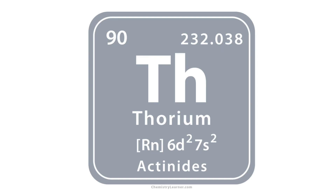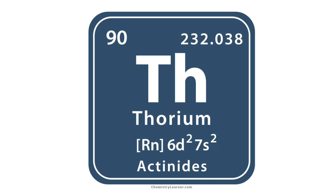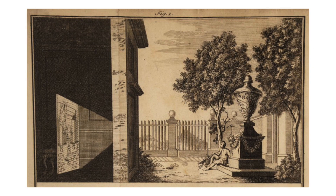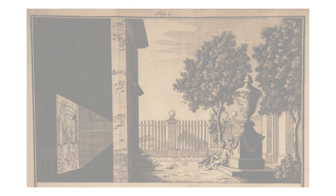The reason why thorium was added to this camera is simple: it makes it better. By adding thorium dioxide to the glass of this lens, it increases the refractive index. That refractive index helps bend light, and in cameras, bending light is very important — you're taking in light from the outside and focusing it onto your film to impose an image. By having this high refractive index, you're able to concentrate that light without causing it to become blurry and distorted, making a nice, beautiful photograph.